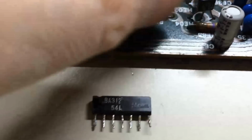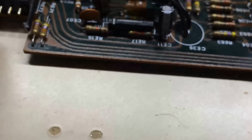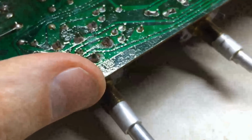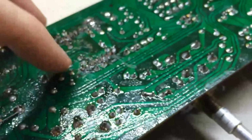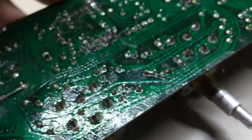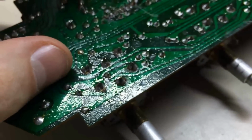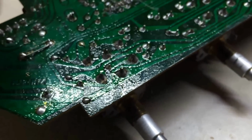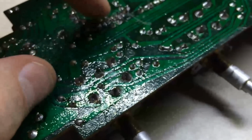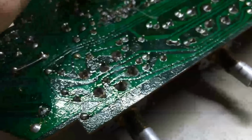What I ended up finding was, when I would test from one lead or the other down here to these pins on the other side, I didn't get what I would call balanced results. In other words, I'd clip here and come over here and start testing one pin at a time. Similarly, clip the third one, come over here and test one at a time. And what I found was I had continuity on some pins that I didn't have on others on the other side.